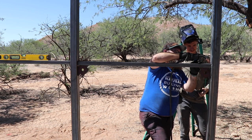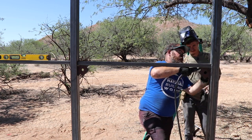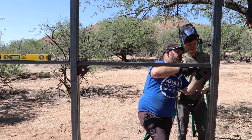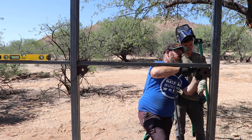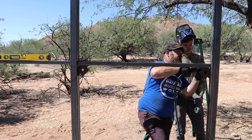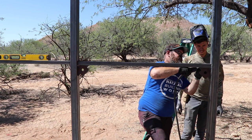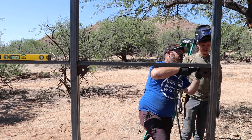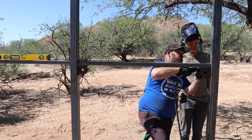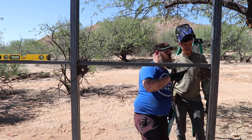It's called throwing dimes. So what you're going to do is circle ones. You're going to steady your hand against something, and you're going down while making a circle, so it's keeping that bead, and you'll see the consistency that you want. You want to move pretty quickly, but not too quickly, so like this speed. So again, you go from this metal to that metal to heat them both up and bond them together, just like that. So little circles. Cool.